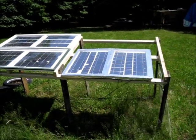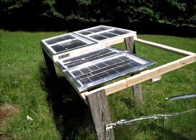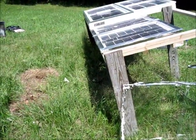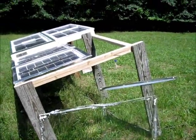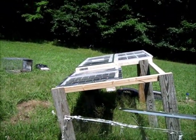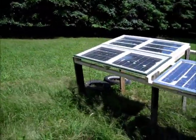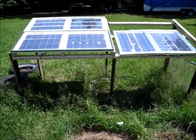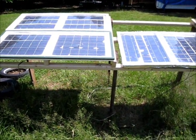This is just a bunch of two by fours and some scrap wood. The front legs are 38 inches and the back legs are cut at 48 inches to give a slight angle, to let the air flow and have the panels angled towards the sun better. This is a very simple project anyone can do to improve their solar panel output.